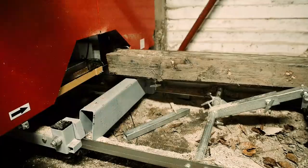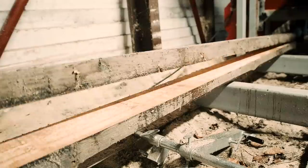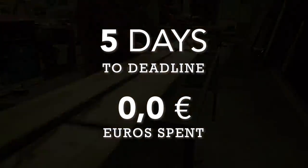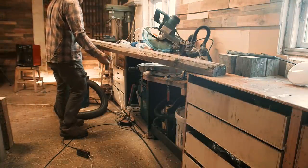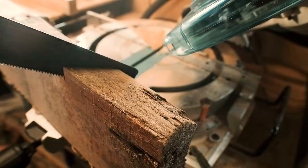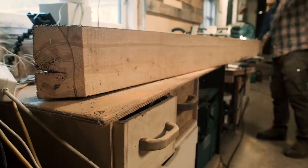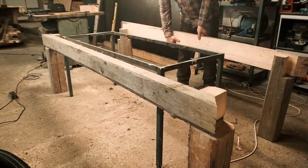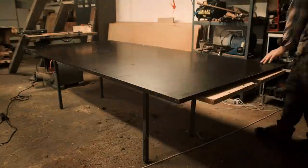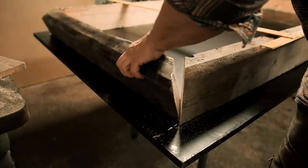It is no problem splitting the pole in half, and without a bandsaw, I probably would have used a handsaw, or maybe a table saw, or my chainsaw, or splitting it with an axe and wedges. Yes, you can do that. I'm turning the whole thing upside down for assembly, and I'll glue and screw the rails together, and I'll mount the legs on them with more glue and more screws.